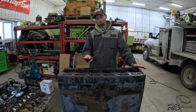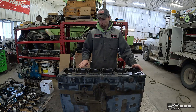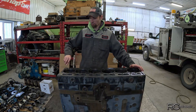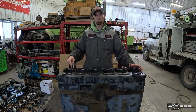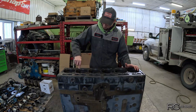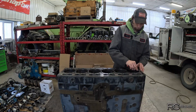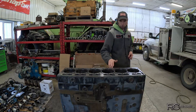Okay, I'll get the liners in here and explain why it's important to check that protrusion - protrusion just meaning how high it sticks up above the deck. First thing you want to do is make sure your counterbores are clean. I like to take a pick and go around the inside and make sure there's nothing in there - if there's anything on my pick, that counterbore is not clean enough. You cannot have any schmutz in there that's going to lift that liner up or make it sit to one side. You want everything as nice and perfect as you can. I wire brushed this before it went to the machine shop, and you always want to do your protrusion checking with the new liner. Let me go grab some liners and plunk them down there - everything's nice and clean and shiny, we'll get started.